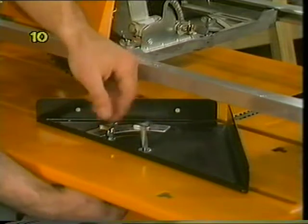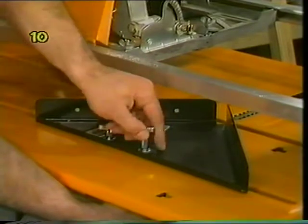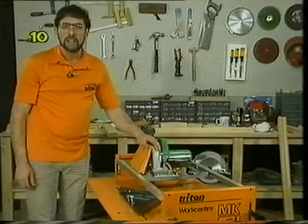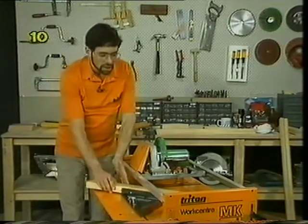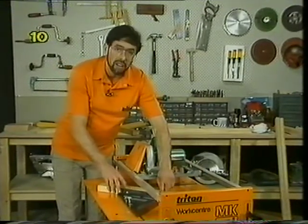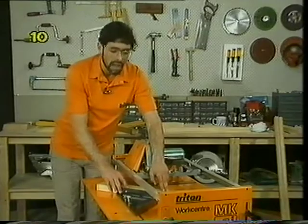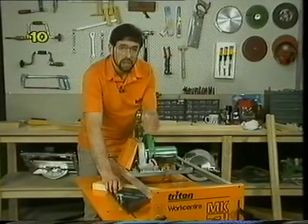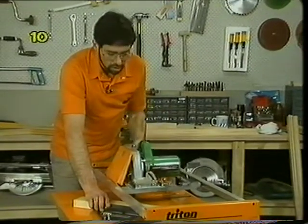Let's lock it off here — loosen the large T-knob, push it down, turn the locking head around and lock it in position. You can fine-tune your angle setting, but this is set at 45 degrees so let's do a test cut. Get yourself a piece of scrap and position it in the work centre so you're creating quite a substantial off-cut. You may want to trim that off-cut again later if the angle setting isn't quite right, so make it big enough to hold. Hold the wood firmly against the sandpaper face, do a smooth even cut, don't push the saw in too fast — it's critical on a mitre cut.